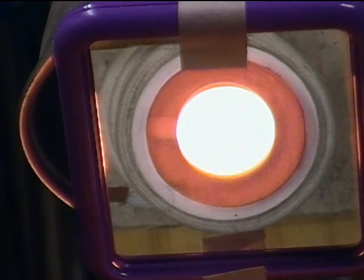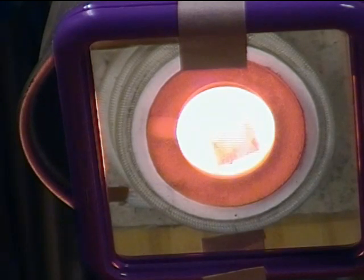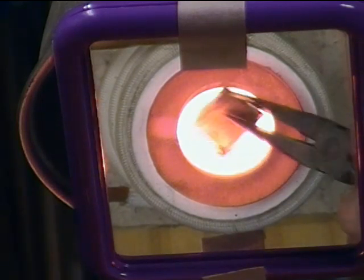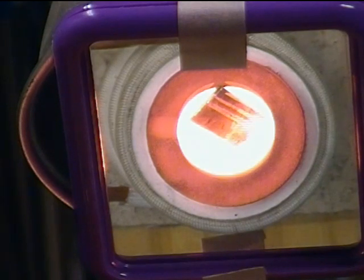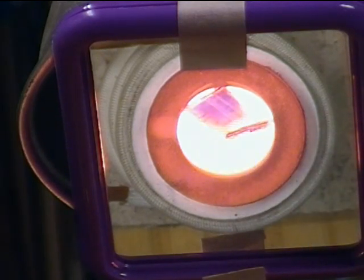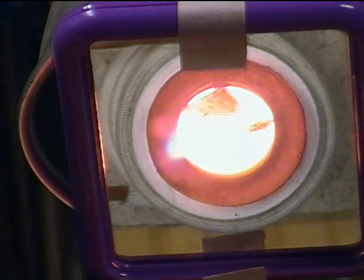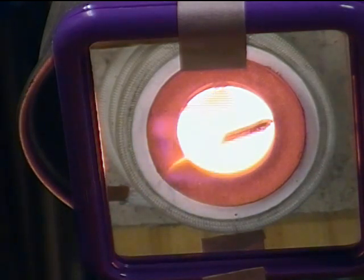Might as well put the rest of this in. This is with no cover. Oh, that was not a good idea, was it? Current, 32 amps, even with that much stuff melted in there. Blue, blue. Somebody wrote and said that that's carbon monoxide, which would imply that the crucible is being eaten away, because that's a source of carbon. That's melting in there nice and quick, again no cover. 31 amps. Water 38.8°C, 42.5 kilohertz.